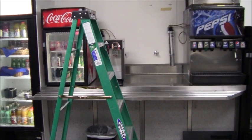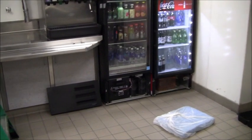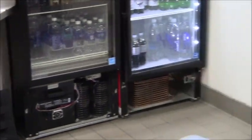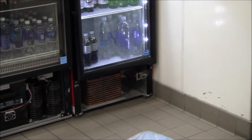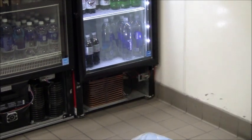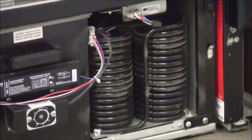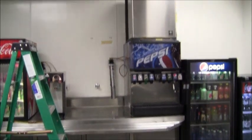I moved some stuff out of the way so I can clean everything off easily afterwards. The Pepsi cover was held on with just one Phillips head screw. On the Coke machine there were four quarter-inch hex head screws located in the corners — one, two, three, four. The coils on those are a little different: instead of being a fin coil it's more of a round coil. That's what the coil looks like on the Pepsi machine.